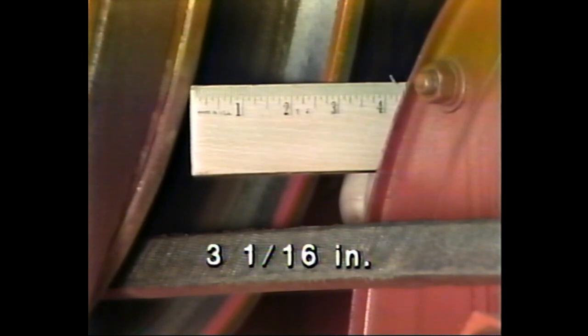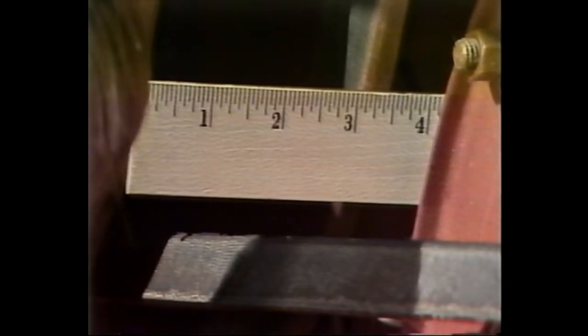On the MF-750 and 760, check the lugs on the cylinder housing to see if they make contact with the low speed nuts, and that the distance between sheaves number 5 and 6 is approximately 3 1/16 inches. If this measurement is incorrect, or the lugs on the MF-750 and 760 are not making contact, adjust the cylinder speed setting with the stop bolt provided for that purpose, as we're doing here. Continue to check these settings and adjust if necessary.